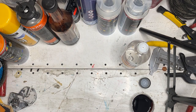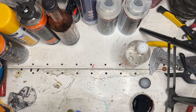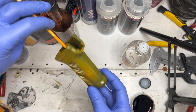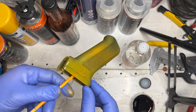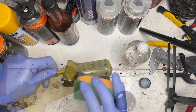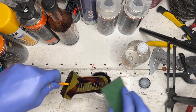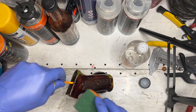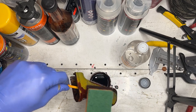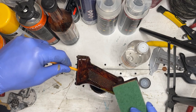We actually tried several others before going with this one. This step is likely the most difficult and requires some practice to achieve the desired result. It is quite possible to mess up on your first try, but don't fret — try again. It should also be noted that your result visually may turn out differently, which is perfectly fine. We're going to be using a regular kitchen sponge to apply wood stain, but a paintbrush would do just fine too. Put a bit of wood stain on the sponge and stain the entire surface using no particular movement pattern. Don't just wipe the grip up and down or left and right — the chaotic manner of the movements is what's going to do the trick and give the grip the right look. Keep in mind that while the paint dries quickly, you should avoid paint runs.